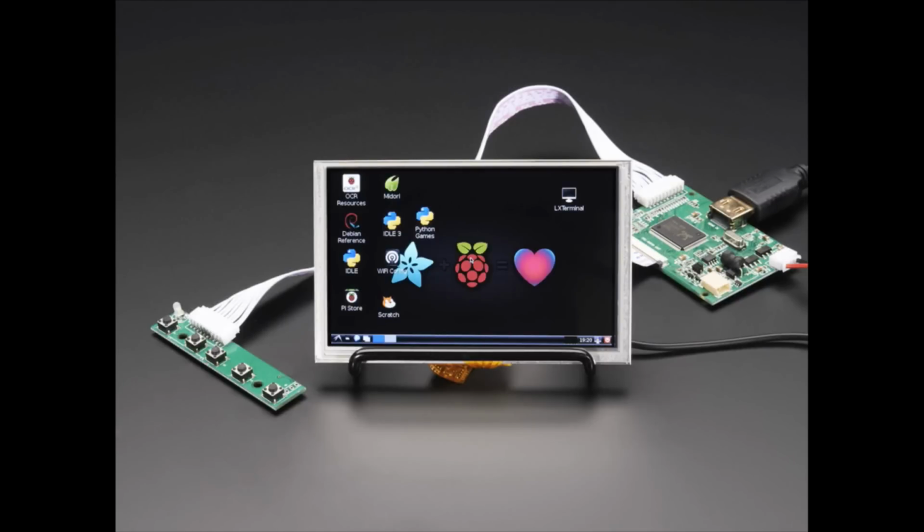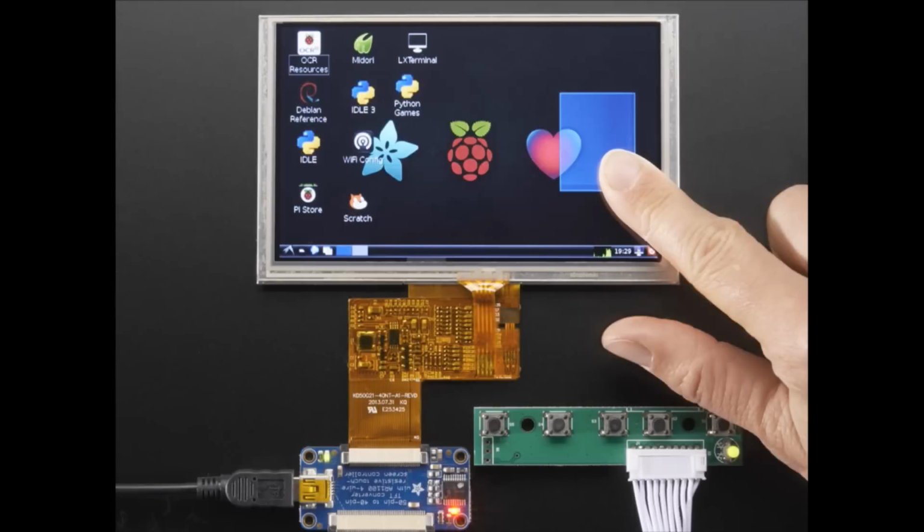and composite in. Basically, these screens have a resistive layer over them, and we split out those resistive lines and connect it to a USB connector, so you can use this with any computer that has HDMI and USB. It shows up like a mouse, and you have a resistive screen. So I can show it on the overhead. I have it plugged into a Pi, but you don't have to use it with a Pi. You can use it with anything you want.